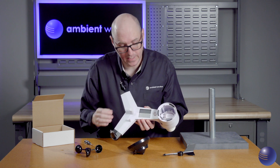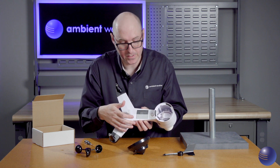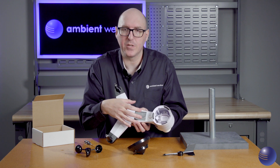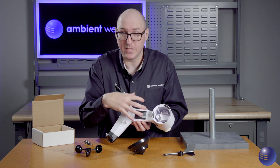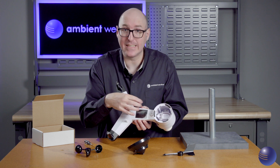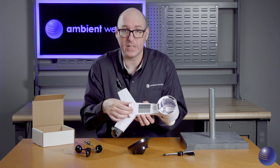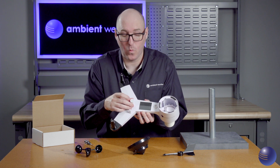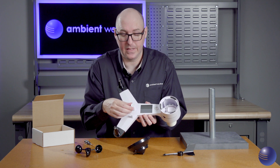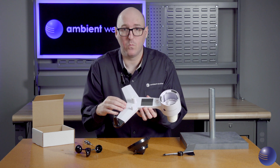We're also going to take a look at our solar panel. We're looking for any type of bleaching out or condensation that may appear on it. This is a sealed unit, so there should not be any condensation on the inside of the solar panel. We're also going to inspect our UV and light sensor — make sure it's functioning properly and that it is clear so it is actually getting solid sunlight.